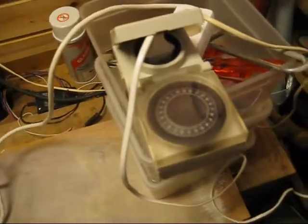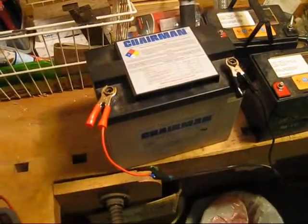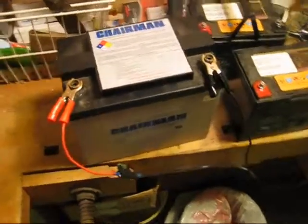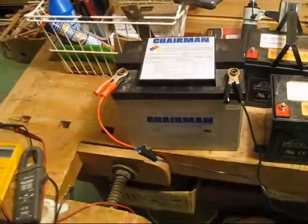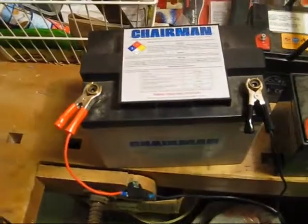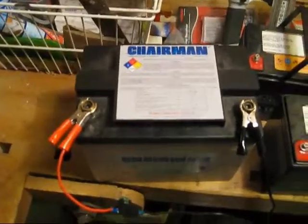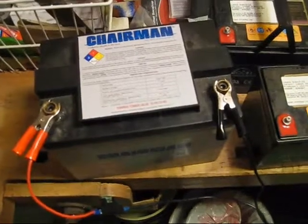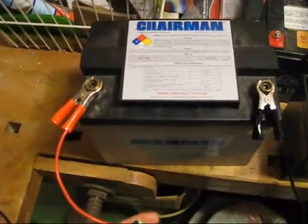Very convenient. And then you can take the hours — if you have five hours of running time, you can multiply with the amount of amperage and then you have the real capacity of the battery. So then you have five hours multiplied with eleven amps — that's 55 amp-hours. One hour in 55 amps or eleven amps in five hours.